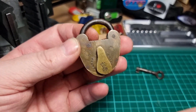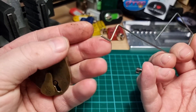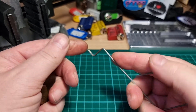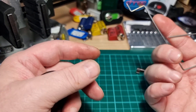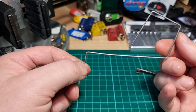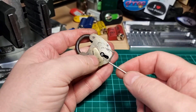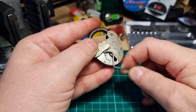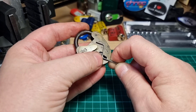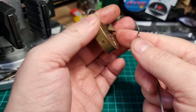So how do we pick this? Well, we can use a bit of wire like that. It's fairly gunky on the inside - you'll have to forgive my fingers. This little bit of wire here I've used for the British sort of 1950s rim locks, quite often found on interior doors of older houses and sometimes sheds. So I'm going to go in, work my way around the post like that, and then use that bend at the end to manipulate the lever.